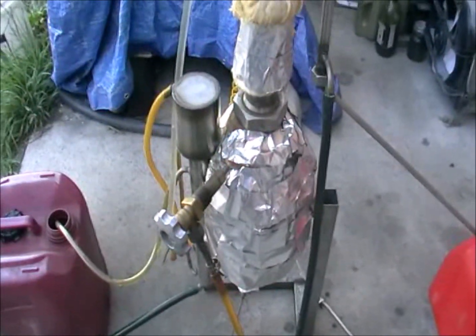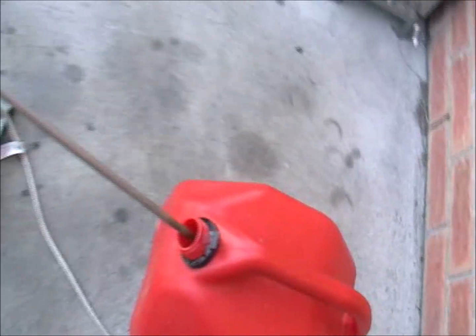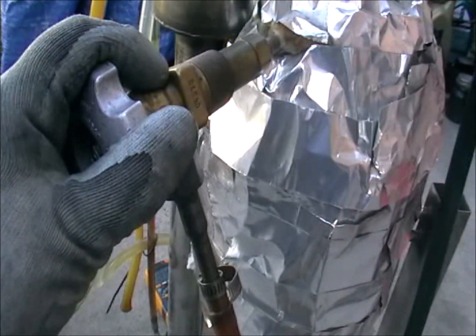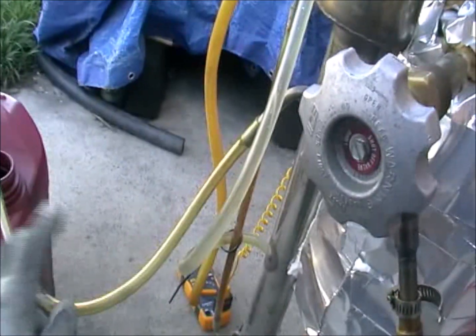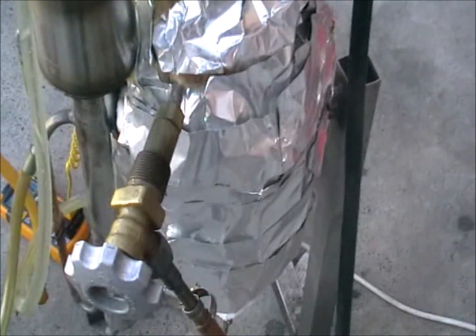The main thing we have to do right now is wait until our oil starts to flow from this tube — it's almost started. Once it starts, it's probably time to open up the valve just a little bit to allow some oil into the system. You have to find an equilibrium between the oil coming out of the distillate pipe and the waste coming out of the waste pipe. It should come out from the waste pipe at a really low rate — either dribbles or a really thin stream.